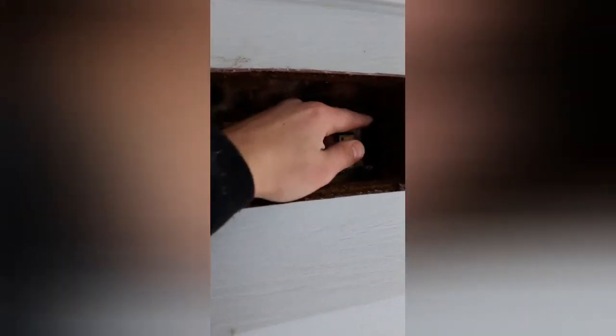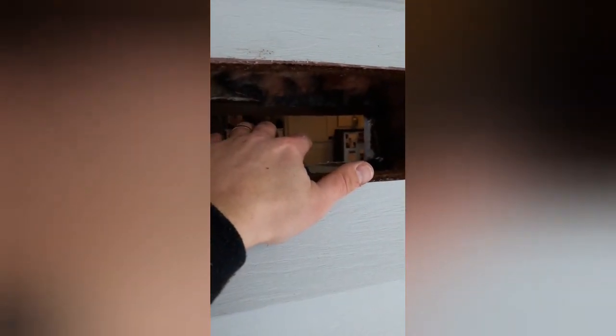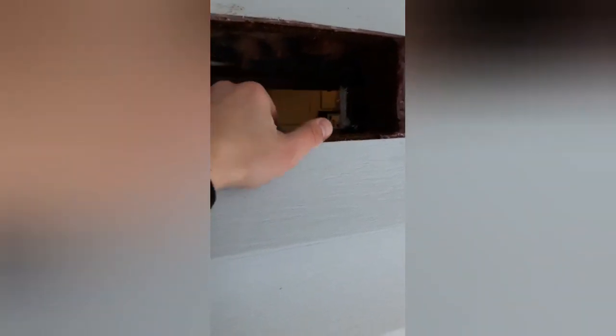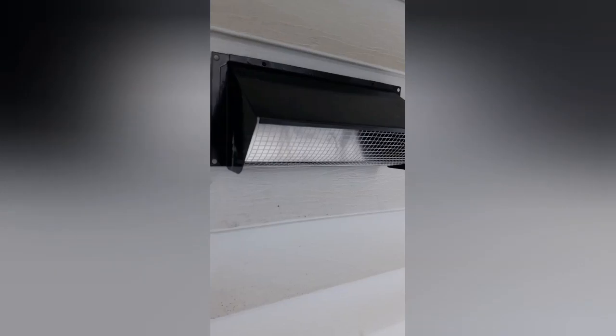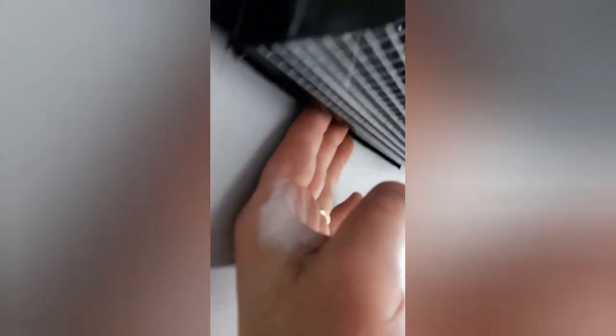I'm probably gonna insulate a little bit more in here just to kind of tuck it in nicely. And then I'll run my plumbing through. Here's the issue I'm guessing people run into, and this is actually why I made this video, because I couldn't find one that had this being installed in vinyl siding, is that you're gonna get it on, it's not gonna be level one way that you put it. You don't want a huge gap down here at the bottom, because you can see that there is room to go in there. There's room for air to get in there.